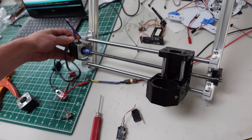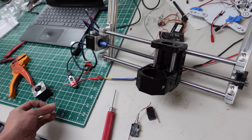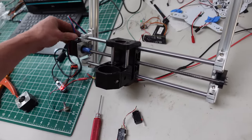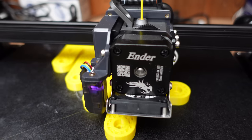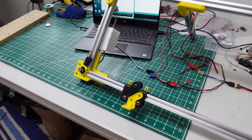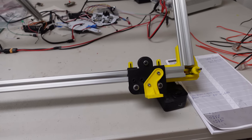Let's put a laser on it. Instead of having the laser pan back and forth, I wanted to have it slide back and forth, so it would be able to use the narrower laser with no lenses attached. At its optimal focal point of about 3 cm it can cut grass very quickly. A cheap CNC x-axis seemed like a good slider mechanism, but it was too short and I was having some problems with the screws, so I ended up designing my own. I 3D printed some big brackets on my new Creality Ender 3 S1 Plus 3D printer — big thanks to Creality for hooking a brother up. These parts join a bunch of 2020 aluminum extrusion together, which is what my new big slider was made of. It was controlled by an Arduino with a limit switch on one end, and once that was pressed it would count the number of steps in the opposite direction and reverse once it got to the end. I probably spent about 6 hours writing the code to use only one limit switch instead of two.